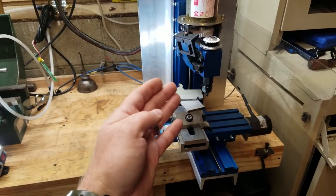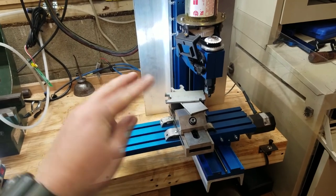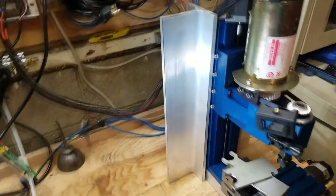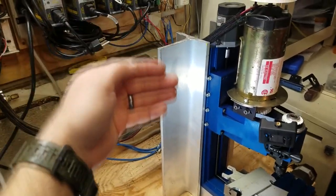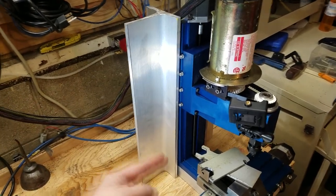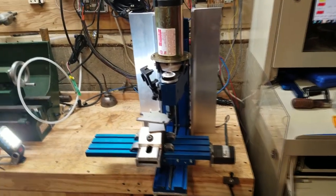Hey, thanks for watching the build video. Quick sneak peek of round two of stiffening. We've stiffened her this way, now we need to stiffen her this way. And we're going to use these aluminum T-slot extrusions. And we're going to drill and tap into here, and down into here. And that should give us twice as much rigidity as before.